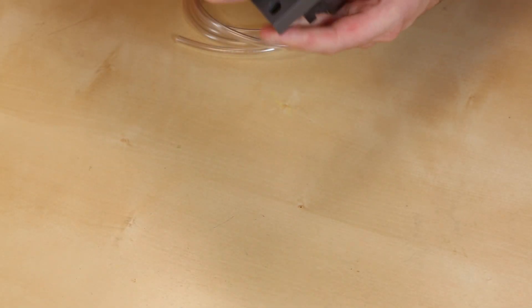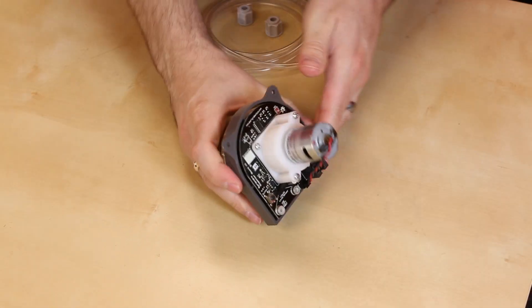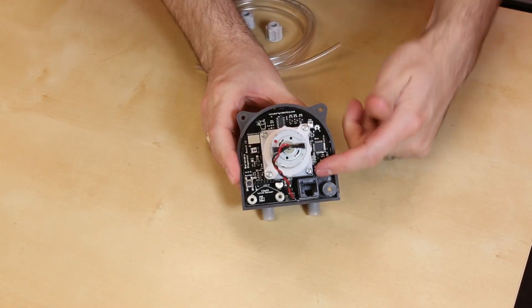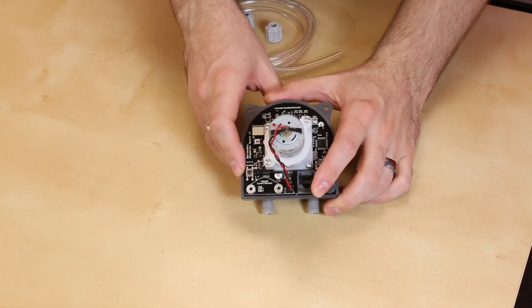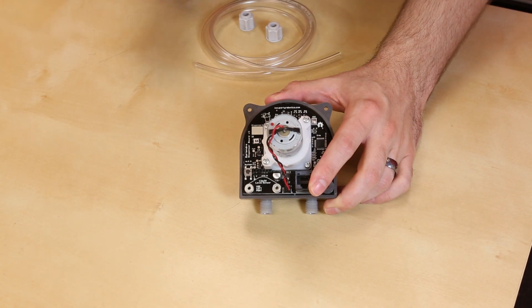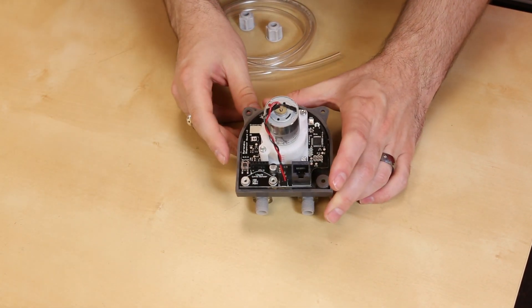Because the pump is not in contact with the actual liquid, this is the pump mechanism that snaps on the outside. On the back side you can see a motor, gear assembly, and the PCB. For connections, there's an RJ45 jack that talks back to your main control center, plus a couple of other connections. I'm going to crack this open and show you exactly how it moves the pump.